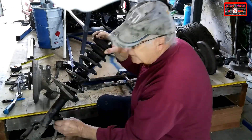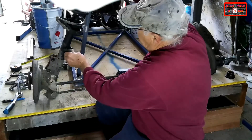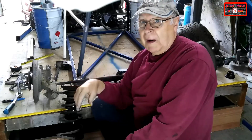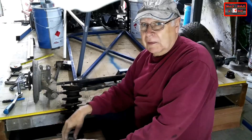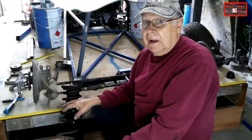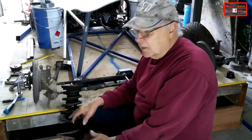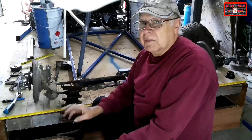I've realised that this unit is too big physically and it's ugly. The back of this special now weighs two parts of bugger-all compared to what the original or any road car would weigh in the rear. So this spring and the strut are going to be about eight times as stiff as what is needed — it wouldn't move at all. So I've got to replace it with something else.